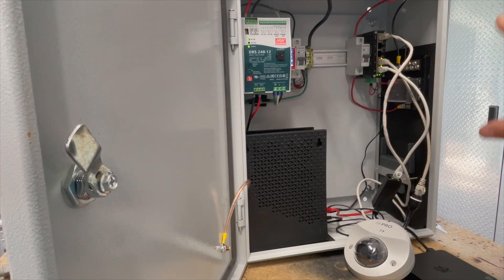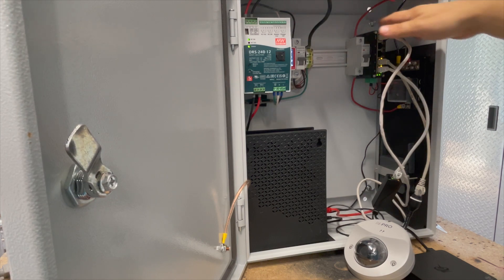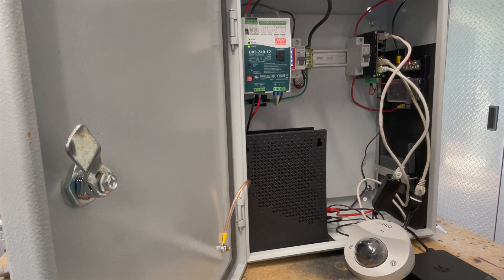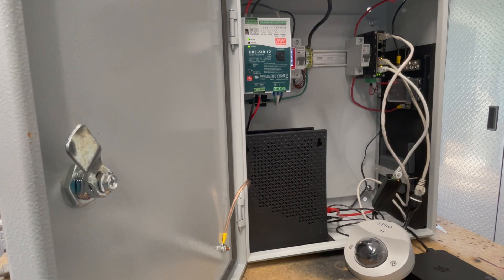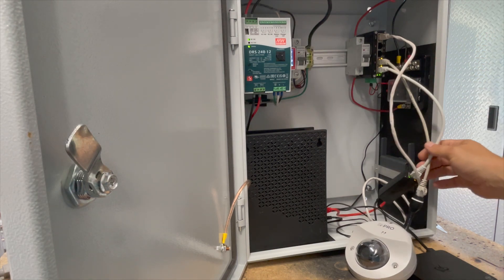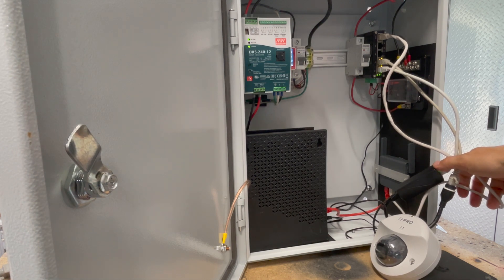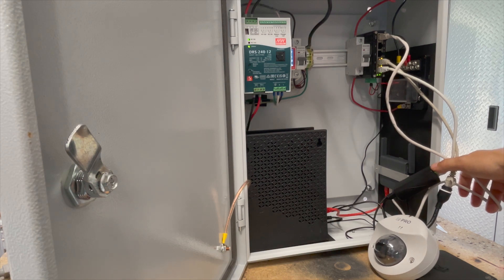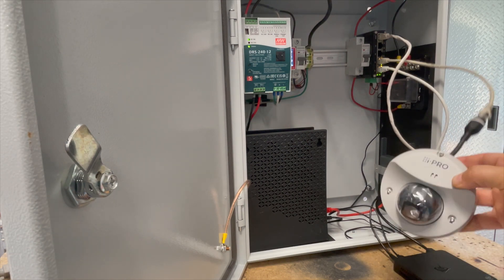The wiring isn't cleaned up yet since we'll do that after the final bridge PC goes in. This POE switch is worth covering in a future video — it's running off 12-volt DC and outputting standard 48-volt POE, which is not very common. It has its own built-in step-up transformer. In past videos I've used an external 12V-to-48V DC-to-DC step-up transformer into a traditional POE switch; this just incorporates that together. Down here we've also got a small mini router that does WiFi inside the metal enclosure — the WiFi won't go far, but it's useful so a technician with a laptop can connect to the system without needing a free network port.